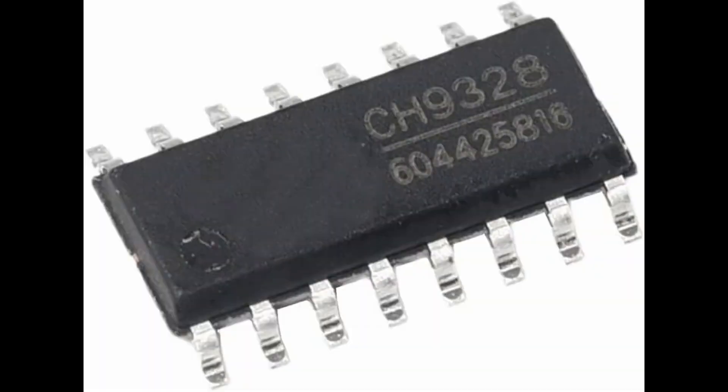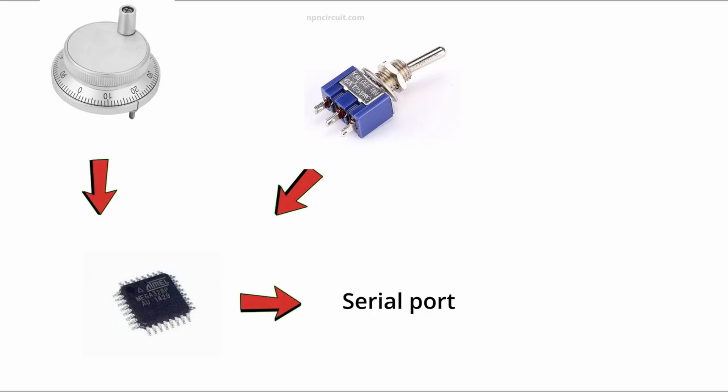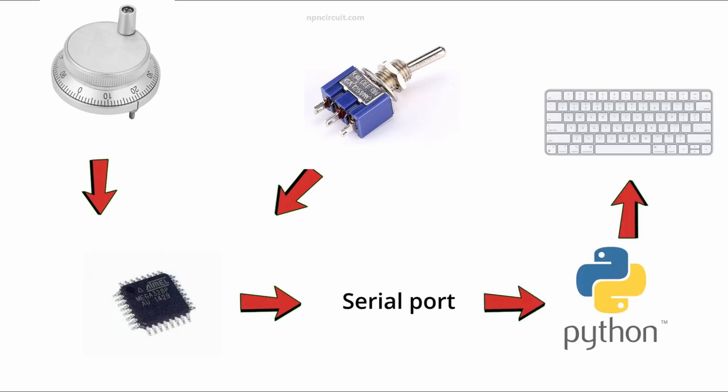After a couple of researches, I quickly realized that not all microcontrollers can do this — and of course none of the ones I have include the chip which allows me to simulate a keyboard. So I found a not-so-common solution: when the microcontroller receives an external signal, it sends a specific code over the serial connection. This is then read by a Python script, which converts it into a string, compares it with a small database, and the desired key combination is pressed.